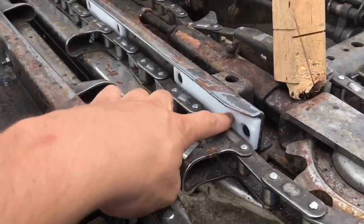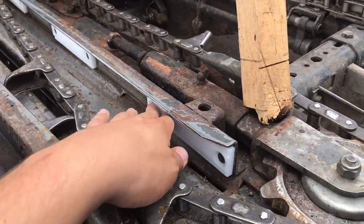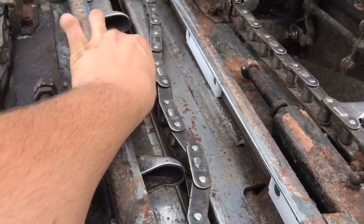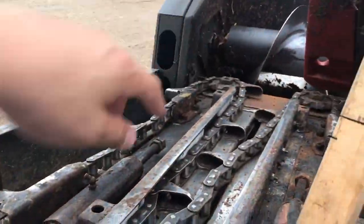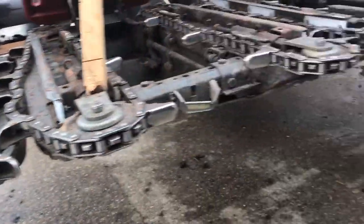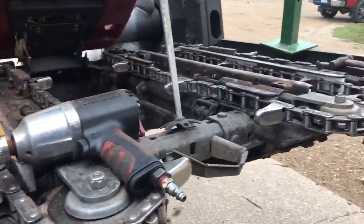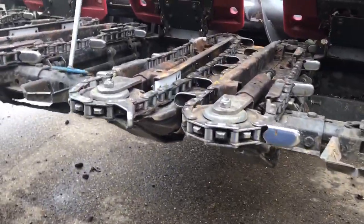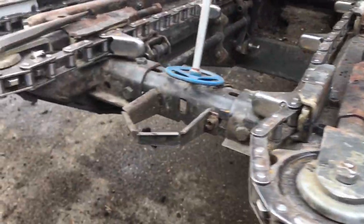Our last little project right now is kind of like a wear guard — they're plastic and they just bolt right on here. So you loosen up the chain and then you sneak three of them in — three of them in for your sixth row. We're working our way across here doing that, and after that we'll tighten the chains back up where they need to be. Then we'll push grease back in. I got the zerks off of these to push the bad grease out, then tighten them back up and put the good grease back in.